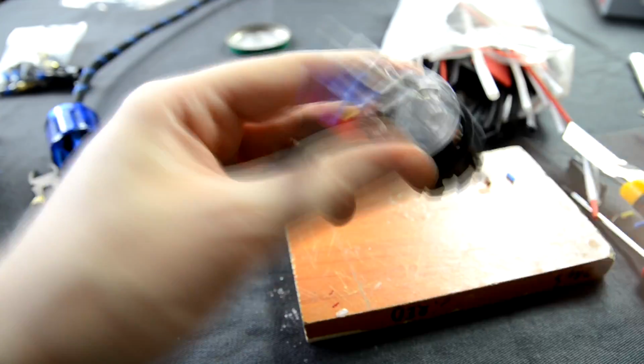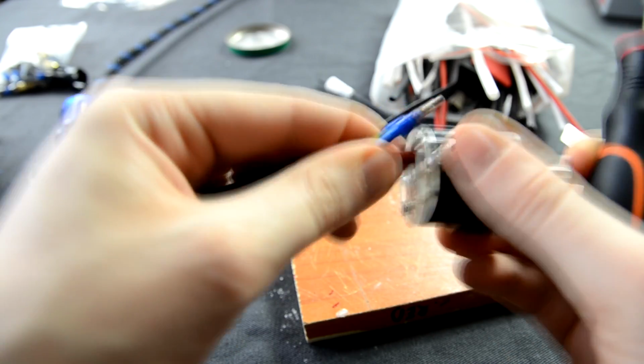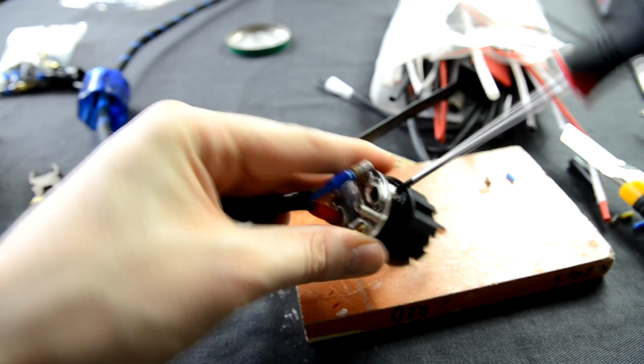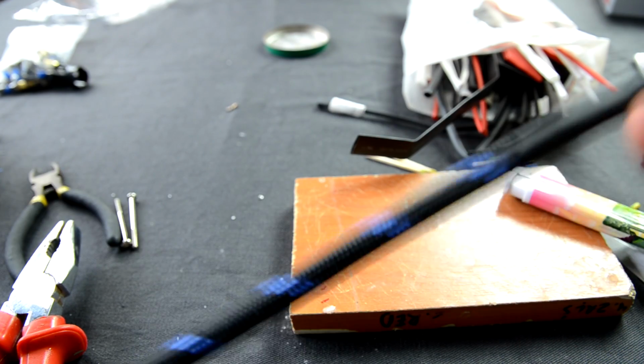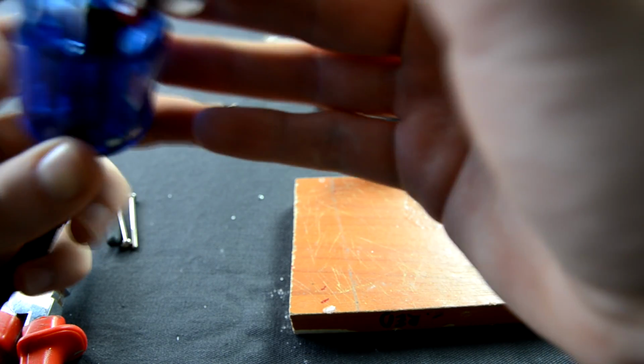Also, it's time for us to add the IEC jack. Main thing to remember is the international wiring color codes. Brown is hot, blue is neutral, and green/yellow stripe wire is ground. Adjust the screws so that wires would hold in tight. Before we finish our job, add the heat shrink tubing and add the remaining parts of the IEC plug.